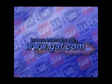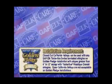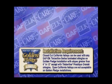See www.gaf.com for details. Closed-cut valleys can be used with any GAF Elk Timberline Series laminated shingles on Golden Pledge installations with slopes greater than 4 in 12. Open California valleys are not acceptable on Golden Pledge installations.